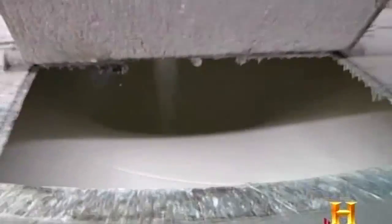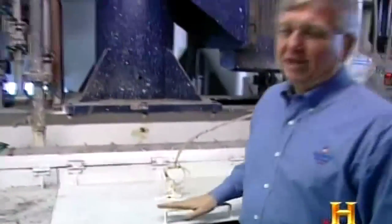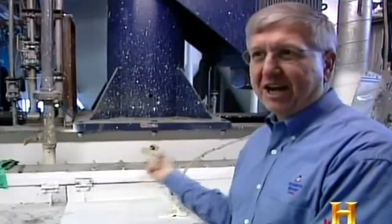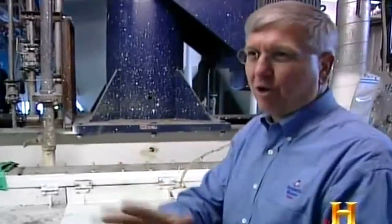Back at the Newark plant, the TiO2, water, and latex resin are becoming one. This is a 10,000-gallon holding tank. The paint that we mixed earlier, we pumped it in here. We added the titanium dioxide slurry. We added latex, some other ingredients to finish the paint off. This agitator will keep it mixing while we do the quality check.